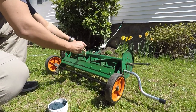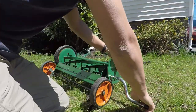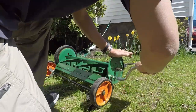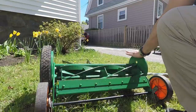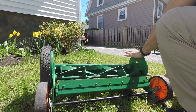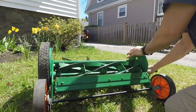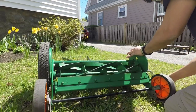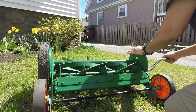The idea is that you're going to be using the crank to turn the cutting reel backwards, and the sharpening compound is going to be in between the cutting reel and the cutter bar, sharpening the two metal surfaces. The instructions say to do this for 8 minutes until it becomes easier to turn. I've also read other instructions where you can push the lawnmower backwards to do this for about 8 minutes, but I'm using this crank which came with the sharpening kit in this video.